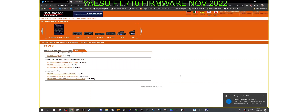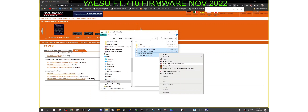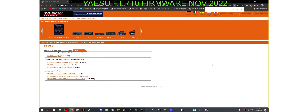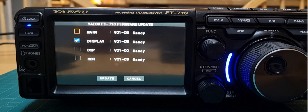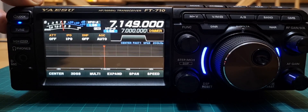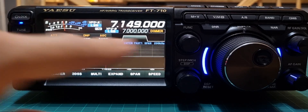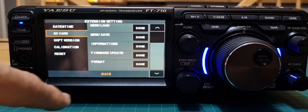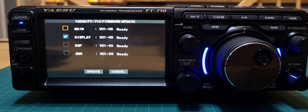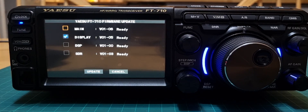What you do need to do is also copy it when it's on the SD card — copy it and then click FT710, right-click and Paste — otherwise your radio doesn't see it. At this point I realized you do need to tick the little box that says 'Main' first. Back at the radio, push the SD card in, click No this time, then go to Function, Extension, SD Card, and this time click Firmware Update, then Done.